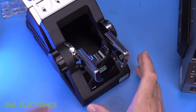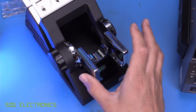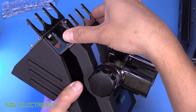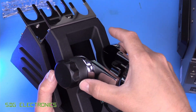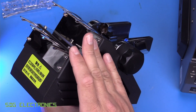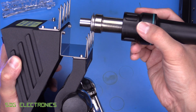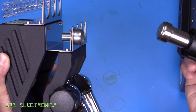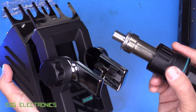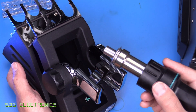That is solid metal and you can adjust the angle of it — it's got certain locking positions, so certain preset angles, so it won't just slide down. It actually comes with two of these cradles, and you can remove the row of nozzle holders and add the second cradle to the top, so if you've got two hot air stations you can have just one stand with the two handpieces stacked on top of each other. These areas here also help you remove a nozzle and put a new one on while it's still hot — you slide the nozzle between these fingers, pull the handpiece away, and swap it for another one, which most hot air stations don't support.